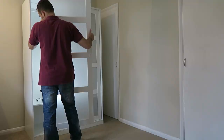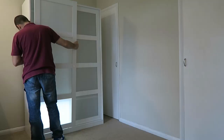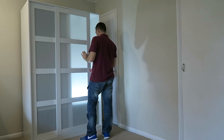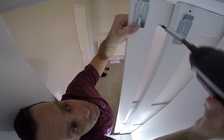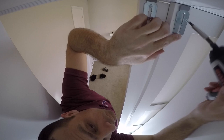Exactly the same for the other doors — the outer doors. Just find the rail, place the hinge in; there's no lock or anything, they're just placed in. Once you position the top hinge, just slide the hinge up and you kind of lock the bottom as well. The bottom hinges are adjustable, so you can adjust if there's space on the side later or if you have uneven floors. Fix the other side exactly the same on top — slide the hinge up and place the screw, first the top one then the bottom one. That's why we didn't fully tighten the screws at the beginning, so we can position the hinge up or down. In this case up, because we're securing it — two screws, secure them, all done.